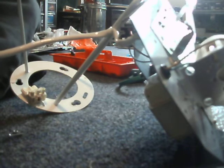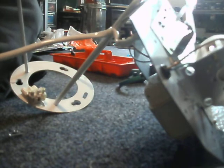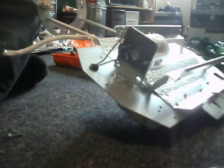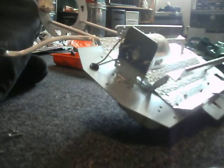So yeah, I'm going to do two tests. See if it fires up minus the photocell. And then, I'm going to put the photocell on. Now, I do know how to wire it up, because there is directions on the back of this. Live out is the red, so that's what I've got to connect to the lamp, basically, and brown is live in and blue is neutral. Simple. One of the reasons I actually grabbed these was because of that photo cell.